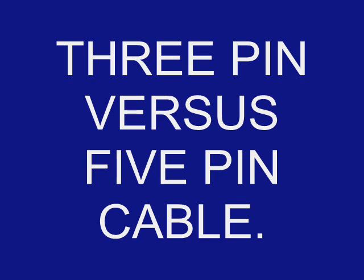3-Pin vs. 5-Pin cable. Whenever this topic is mentioned at the standards meetings, the room gets very tense. There are strong opinions on both sides. However, the fact is, the original standard written in 1986, and in every revision since, specifies the 5-pin XLR connector. The most recent revision goes so far as to specifically exclude the 3-pin XLR as an acceptable DMX connector. So according to the ANSI standard, to be called a DMX cable, it must have 5-pin XLRs on each end, or more accurately, it must not use 3-pin XLRs.